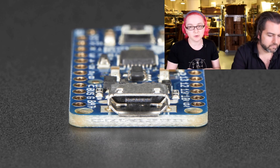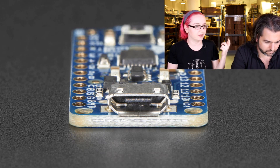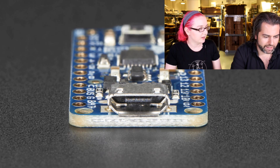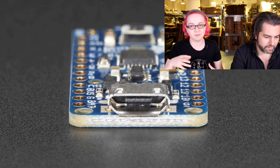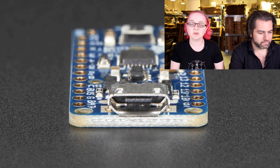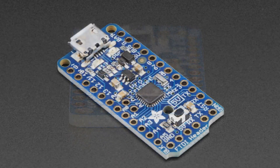We got really good at micro-USB layouts — we do the man-pry test where you try to pull it off the board using the USB cable. You actually tore the board in half before managing to pull the part off, because it's got the two hole pins. You plug it into your computer and just have to install the driver on Windows — on Mac and Linux you don't. It works with Windows 8 and all that. You can upload code over USB, but it's not a USB to serial converter — the bootloader just runs on USB, which is convenient for projects you've already debugged.